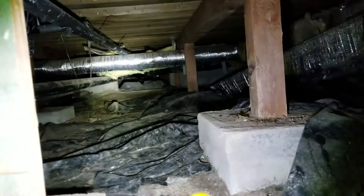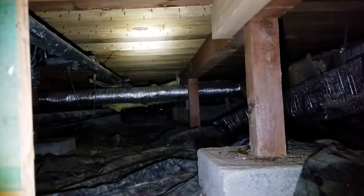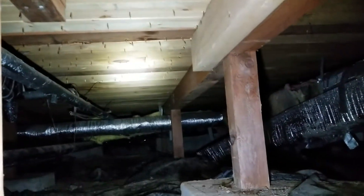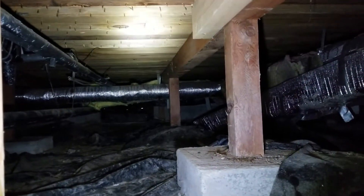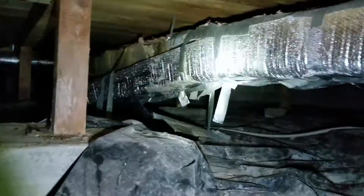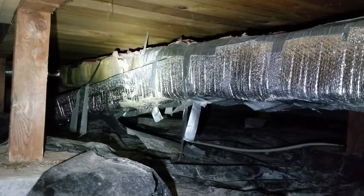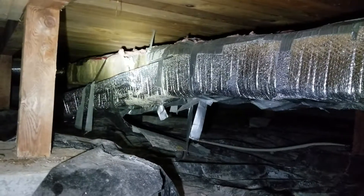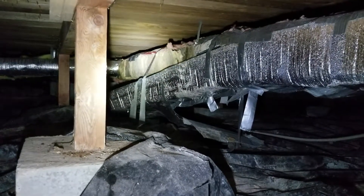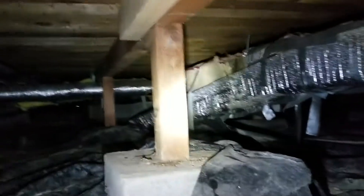Here's a quick description — this is your bare floor. We want to insulate that, and it's car decking, so it's inherently leaky. Putting insulation across it is going to get twined so we can bridge those gaps. Notice that dark stripe — that's where there's a seam in your ductwork. And down there, see the darkness around the duct where it comes out? That's leaks all through, and insulation is falling off.